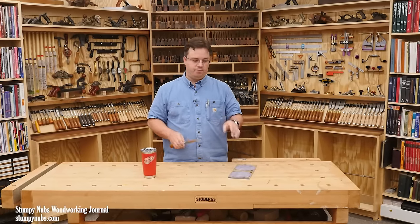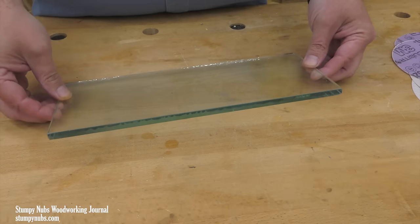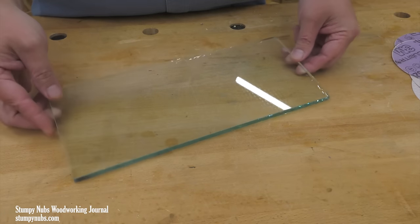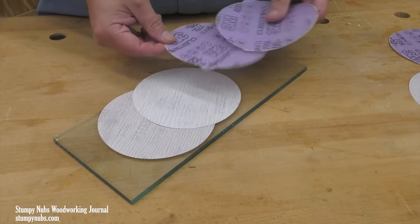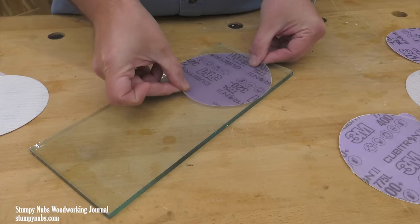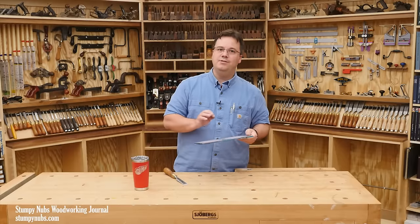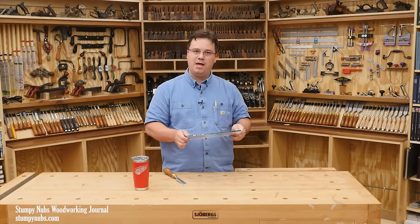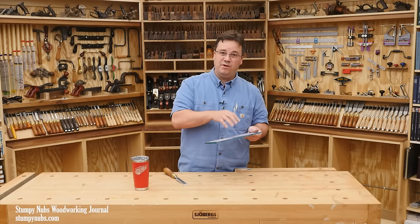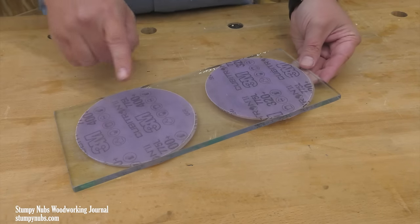It's all pretty simple. I have a 5/16-inch thick piece of tempered plate glass, which gives me a perfectly flat surface — essential for proper sharpening. I've got four adhesive-backed sanding discs stuck to it in four different grits: 320, 400, 600, and 1000. Up to this point, this may all seem pretty standard for the scary sharp process — sandpaper on something flat. But the key to this variation, what changes everything in my opinion, are those 320 and 400 grit discs.